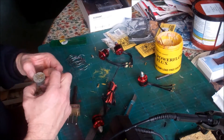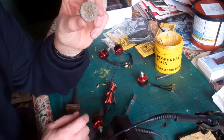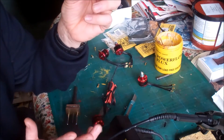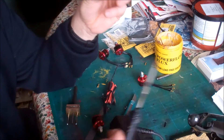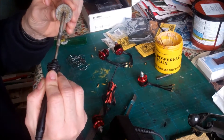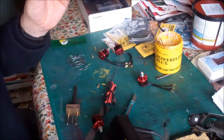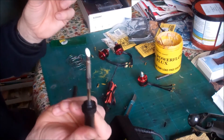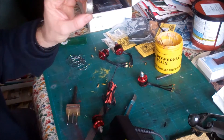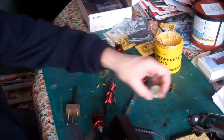Another good thing from Eileen's Emporium is this tip cleaner — I've lost the lid. It's for cleaning the tip of your soldering iron, and this is very important during soldering. You just press the tip in, give it a little rub, then wipe it on a wet sponge, and you have a nice clean tinned tip. I hope you all have a little damp sponge. It lasts ages and I can't remember how much it was but they're not that much — well worth it.